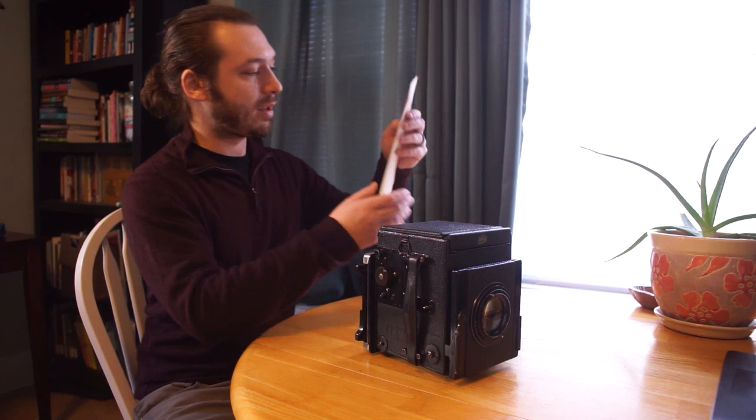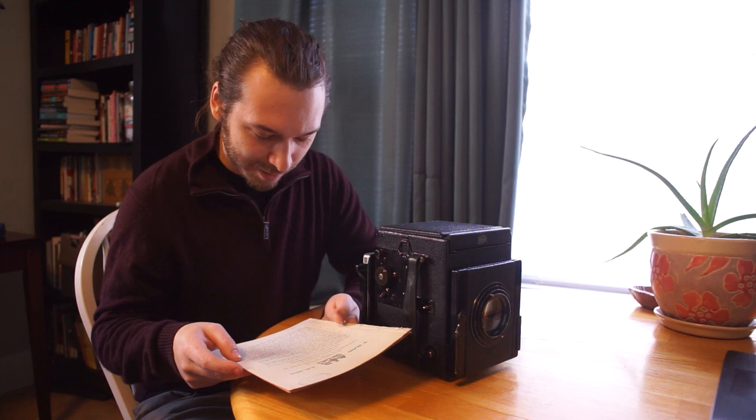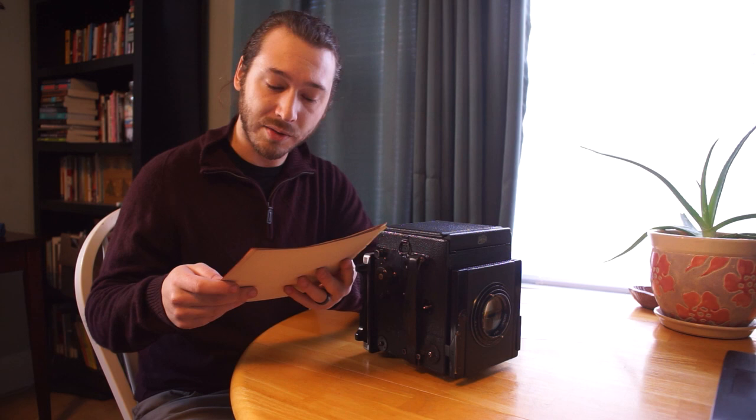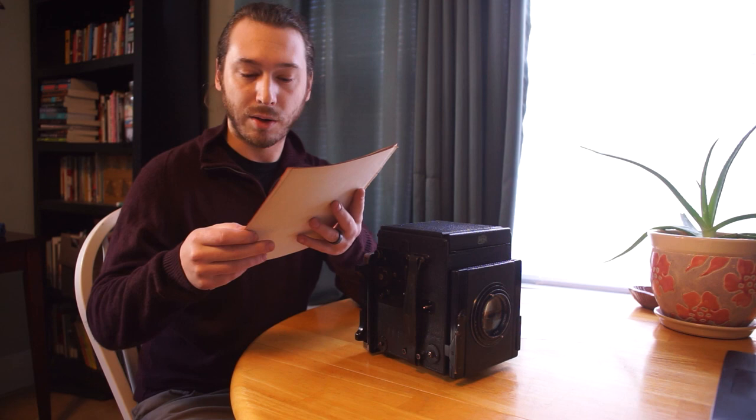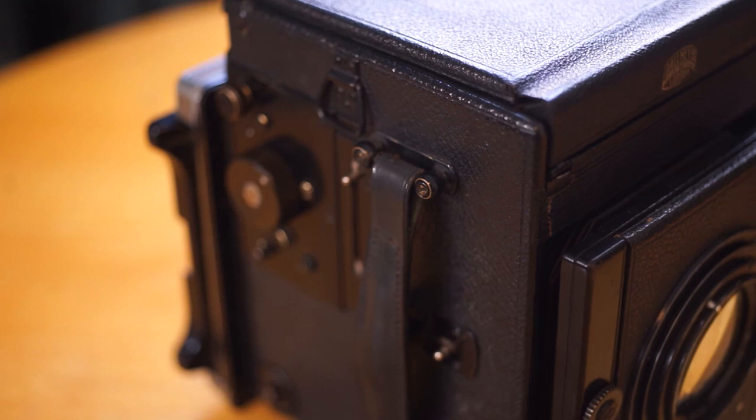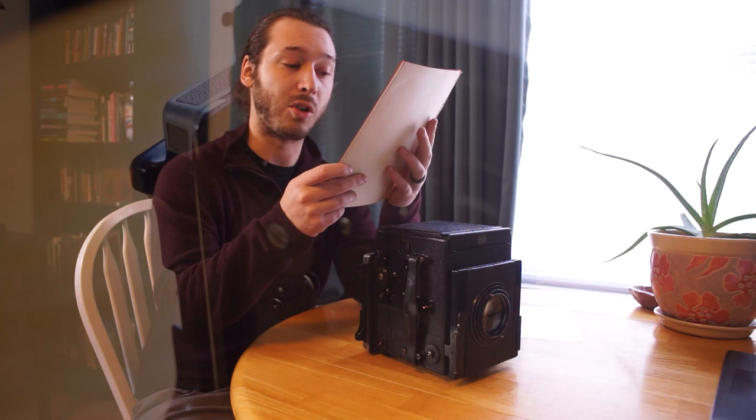We have conveniently an original copy of the 1904 patent. He says: 'My invention refers to the class of camera known as the reflex type. The difference of reflex cameras from ordinary cameras being that in the reflex, a hinged mirror is capable of being swung to an angle of about 45 degrees, intersecting the lens and the sensitive plate.' He goes on to describe how a photo is made and then says: 'In reflex cameras, especially where the focal plane shutter is used, there is not sufficient length to move a mirror on a simple joint and use lenses of a short or normal focus. My improvements enabled me to use such lenses.'